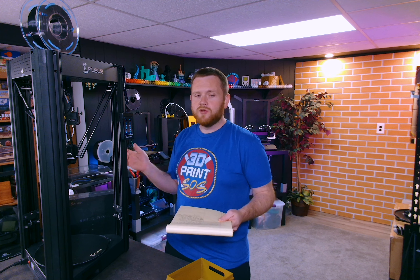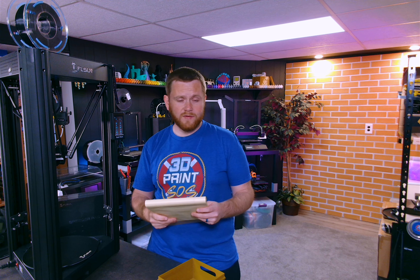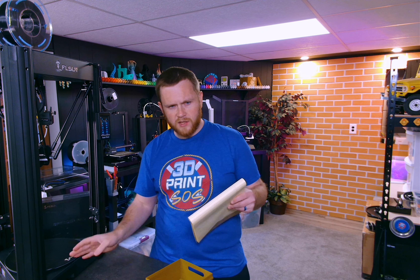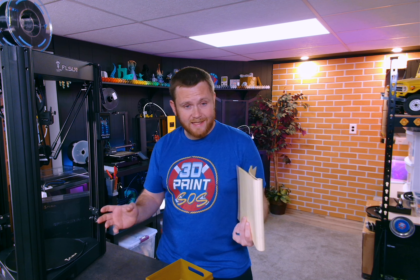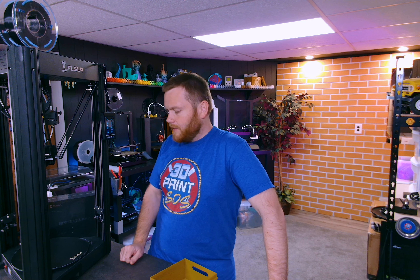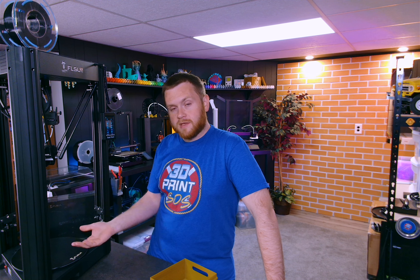Let's dive into the cons and pros — in our case, the cons and pros. I've really tried to look for negatives. The first one, right off the bat, is the size. The build size is 260 diameter round plate and 330mm height — about average for a machine — but the way a Delta works it needs all this space for the rods and the flying gantry system. This is a huge machine and it's actually going to be a challenge finding a spot for it. If you're looking for a Delta, especially of this size, you've got to figure out where you're going to put it.